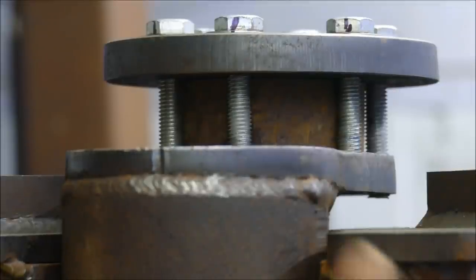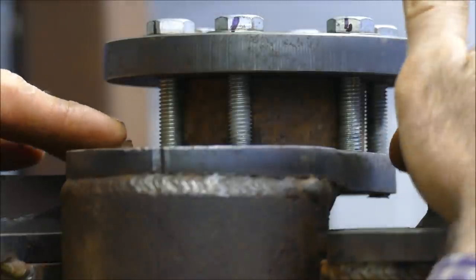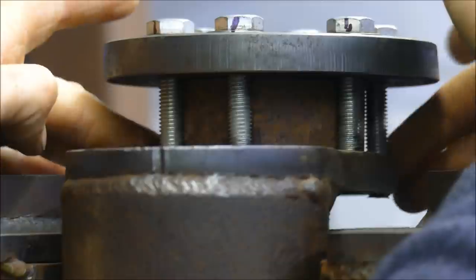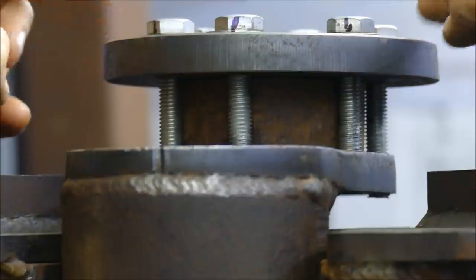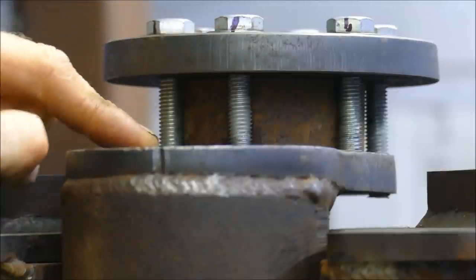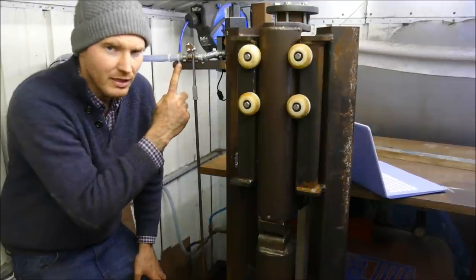So I think it's worth mentioning that with the top linkage design, your one is going to look slightly different. So I'd like to widen this top plate here so that you've got more room for thread in the steel. I don't like the threads being so close to the outside, especially on this side. And also your top plate here will be slightly smaller. It doesn't need to be that big, but that was just a piece of scrap that I had and it just seemed to suit the job just nicely without me needing to do any work. So that's why mine looks like this and yours will look nicer. So what I will do is actually design this to be a bit better. It's not going to be held on using cable ties, for example.